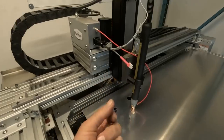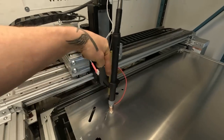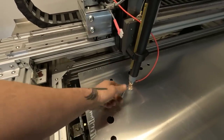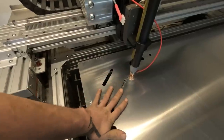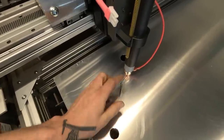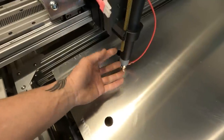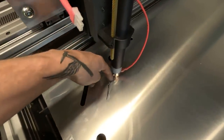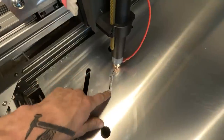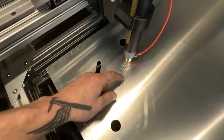The learning experience, I tell you, this is driver error here. I don't know what I'm doing, but this torch height at the same spot has happened to me 3 times in a row. It's my drawing, I'm sure of it, because I did the drawing in CAD, not Fusion. It's a little bit older stuff. For whatever reason, this torch starts driving itself down right when it starts this cut, and it double cuts this one line, so I know that's my fault in the drawing.